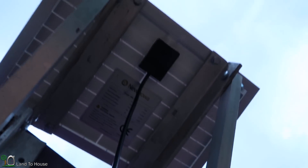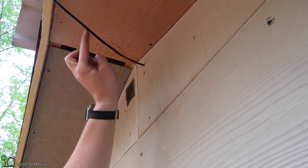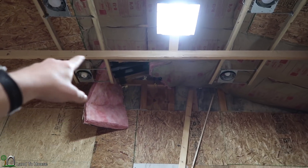I'm going to come back later with a little box that has a larger screen area so it won't restrict the flow as much. The solar panel is up here on the wall. I left a little drip edge so that if water comes down, it finds the lowest point and drips off. I'm going to wait for a nice sunny day and give you an example of the fan running at full speed. I'd also like to close up the insulation, add a little access door, and run some thermometer tests to see if the condensation issue is resolved.